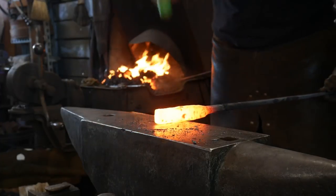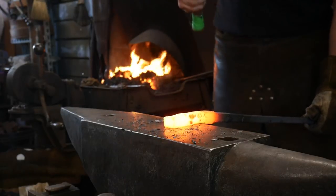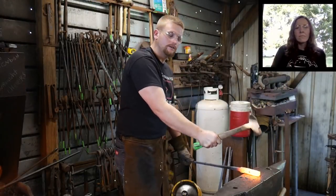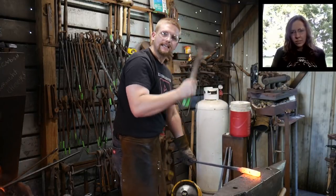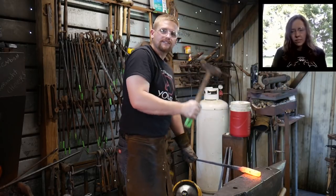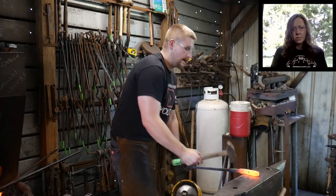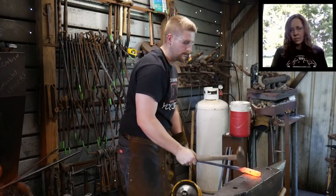What I'm doing here is basically I'm throwing the whole thing from the shoulder. So I'm coming up here, using my shoulder, not just my elbow. I'm using my whole shoulder, and I'm flicking that hammer. And I'm following through with my hand. I'm not stopping my hand, so it's getting caught on my wrist. I'm following all the way through with my hammer blow.